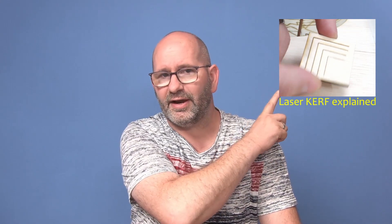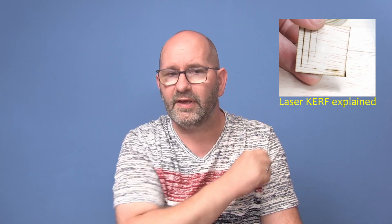I want to start with the way this machine is way more precise. It has a much smaller projection area. There's a video on this channel that explains everything about the curve of a laser — in short, a laser is not as good at engraving in the Y direction as it is in the X direction, or vice versa depending on how the laser is mounted. This has to do with how a laser diode looks on the inside, and therefore all older machines with diode lasers have a slight problem cutting as deep in one direction as the other.